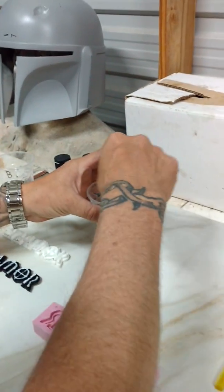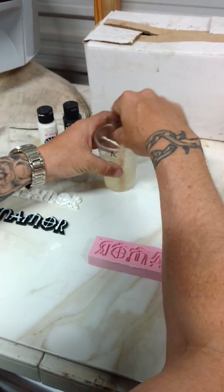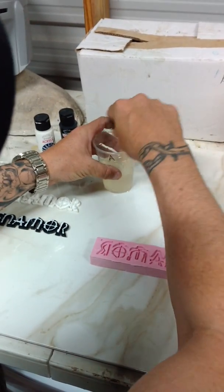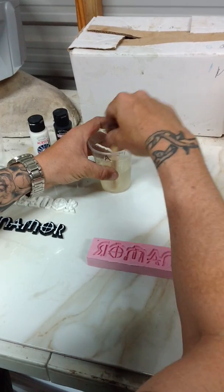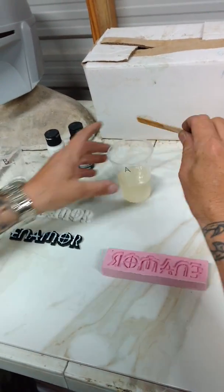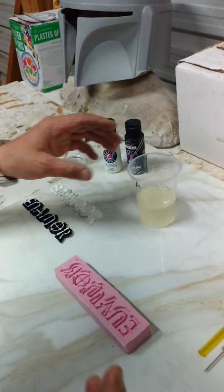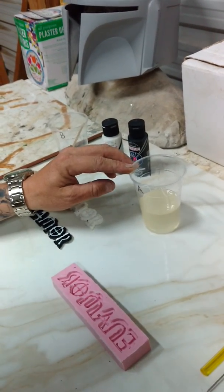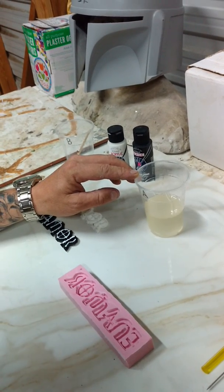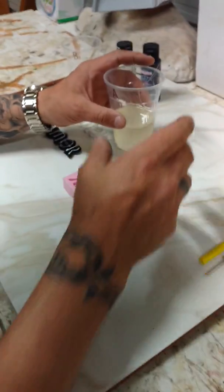These chemicals are all non-toxic, so you don't really have to worry about wearing gloves and masks. I just stirred it up. Now, any liquid plastics like this 65D — and what that 65D means is the different numbers mean different hardnesses of whatever material you're mixing. This stuff right here has a cure time of about 10 minutes.